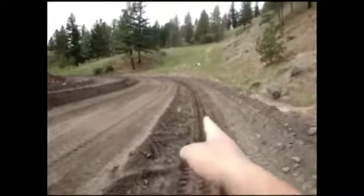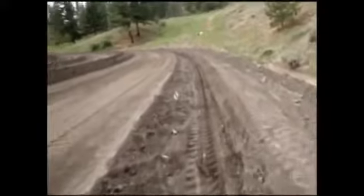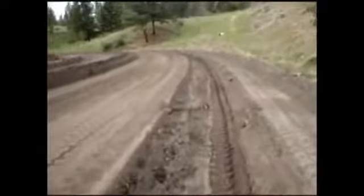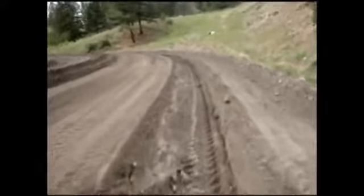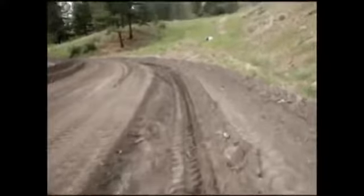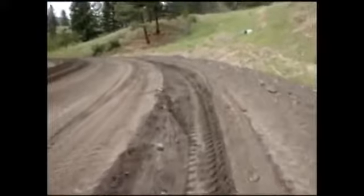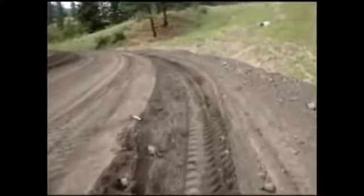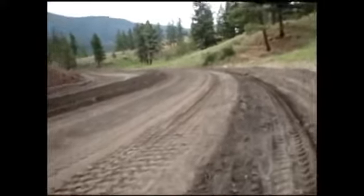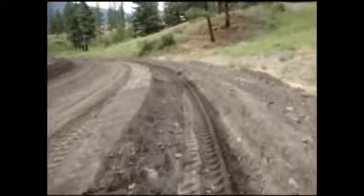And then your tire runs over the little bit that's left at the bottom, and you have a fairly clean looking ditch at the end of the day. So it's not as hard as it looks. The first time I tried it, it was kind of intimidating, never having done anything like that before with that kind of machine. But basically I find that the key to it is just maintaining consistency with your grade on the road surface, and then the ditch pretty much just follows along.